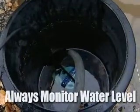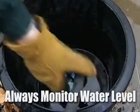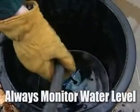We have adequate flow coming out of the hose right now. So at this point, we're going to go ahead and complete the whole drain. We also want to check the depth of the water in here. Make sure we don't run the sump pump dry — that could actually ruin the motor. Let's monitor that.